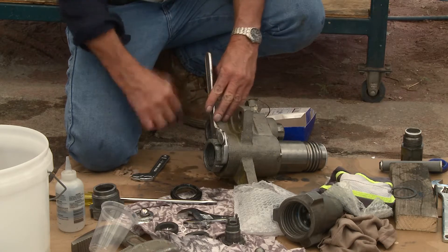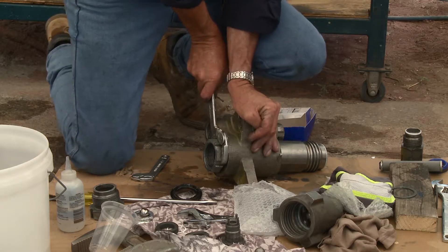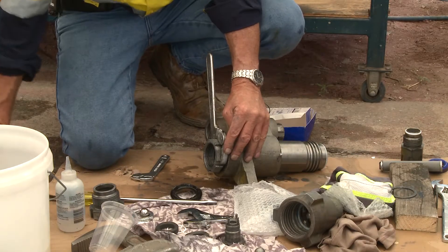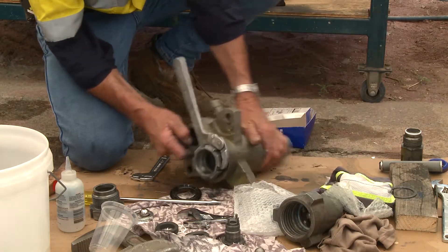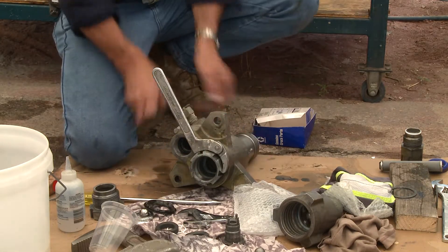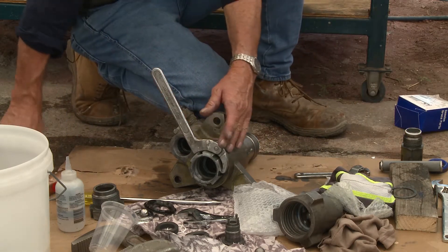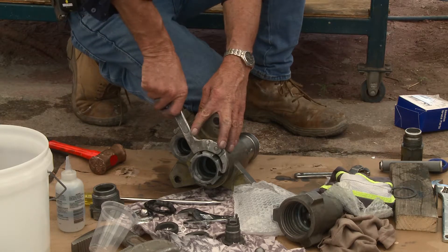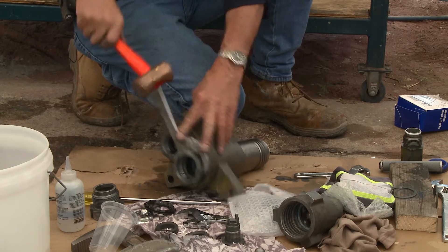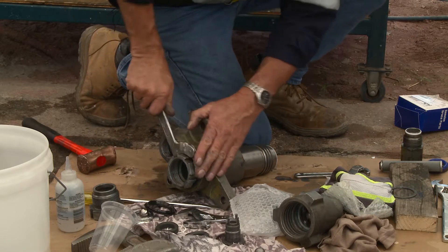Have the spanner towards the base so it won't slip off and hurt you. You need to crack it — by pushing on it with an immense amount of torque you still won't undo it just by turning, so you need to crack it off the thread where there's an accumulation of paint behind it. Position yourself so you're clear of any harm. You can use a length of pipe to help, or just shock it to start the thread undone — like so — and away you go.